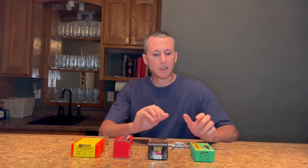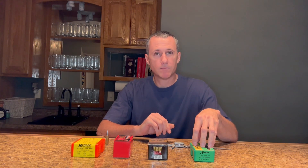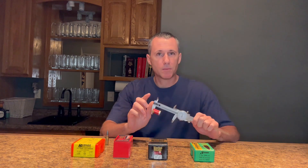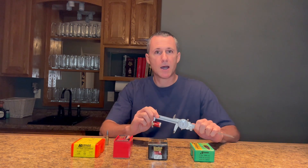Here's the wrinkle in the laundry. Many times, big bullet companies will have multiple point-up dies, meaning even though these bullets are in one box, those bullets may not be the same. In those situations, I use a bullet comparator and I sort the bullets. Depending on how precise you want to be, you can make as many piles as you want.